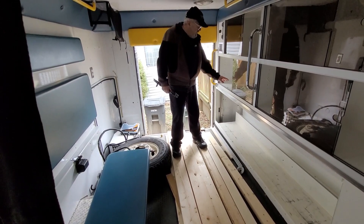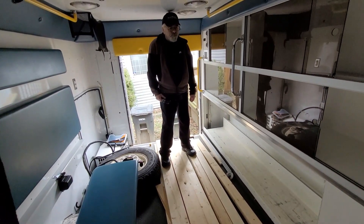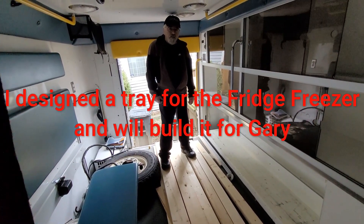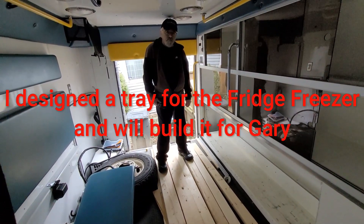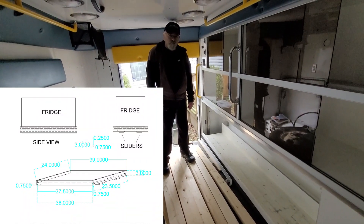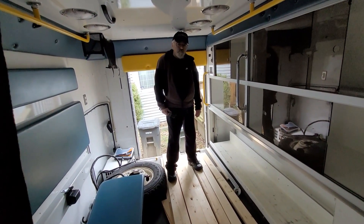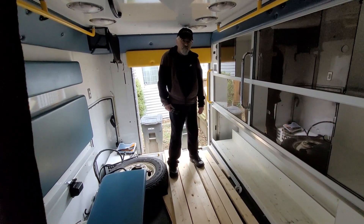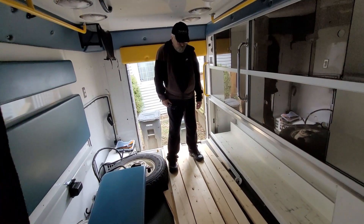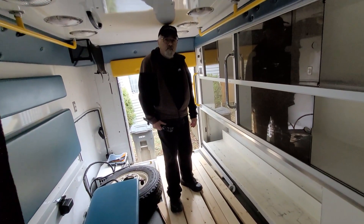What we have to do with this? Well, we can take this out. What I'll do is take all the measurements of the fridge-freezer you have, design it on AutoCAD so we get everything to scale, then I'll build the tray as low as possible so it doesn't interfere too much with the height of the bed. We also have to measure the height of your mattress, sheets, blankets — most likely we'll have to take out that bottom shelf and work from there.